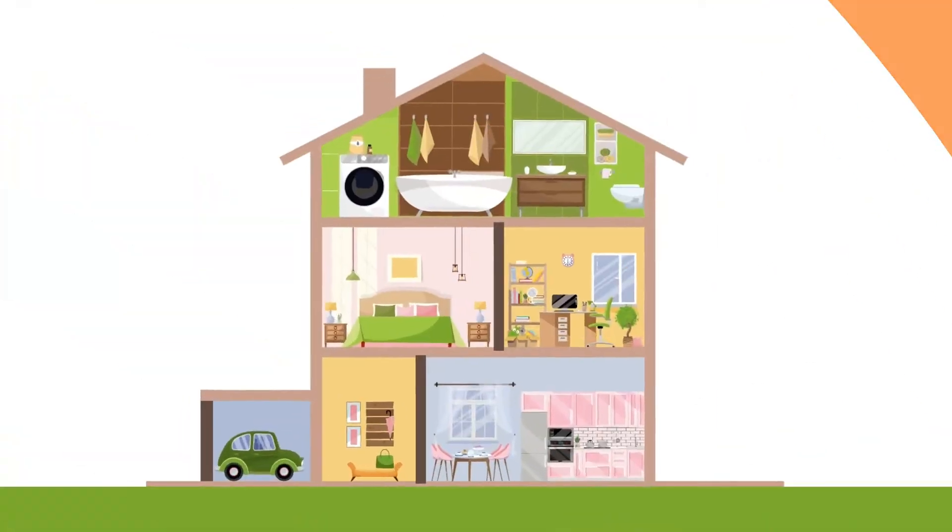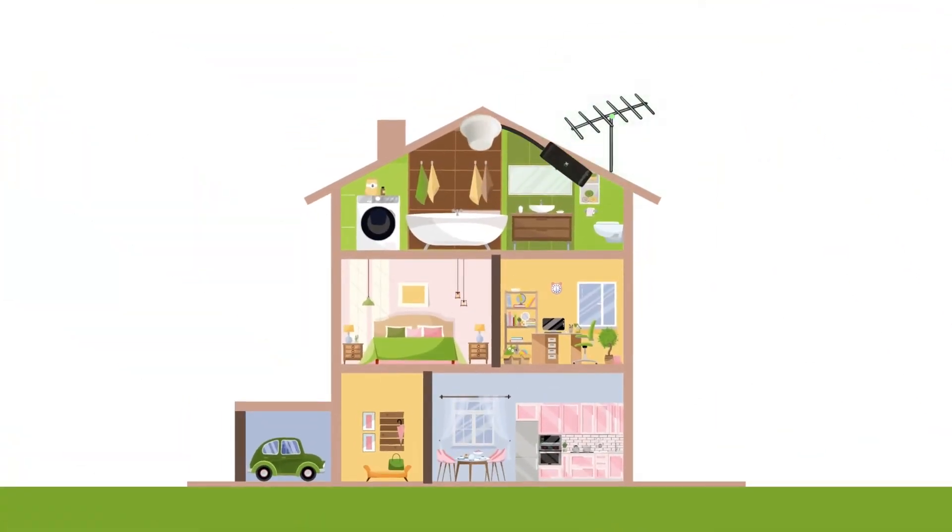In the house, we can have a house pack where we have an external source antenna and two service antennas — one for in the house, one for in the backyard. When we mount these, if you get the error that says 'too close,' it could be that you're getting feedback from the external antenna to one of the internal antennas.